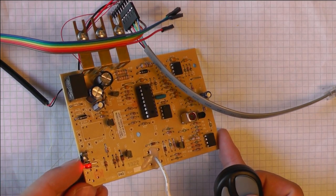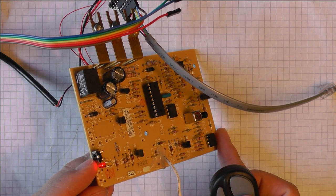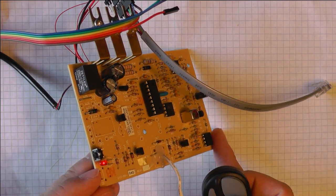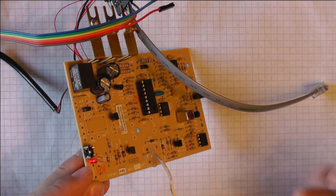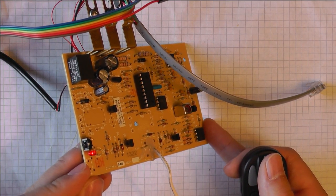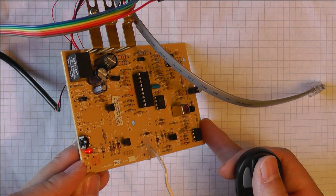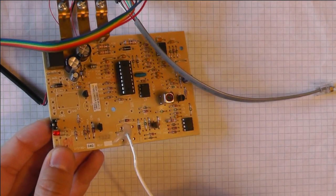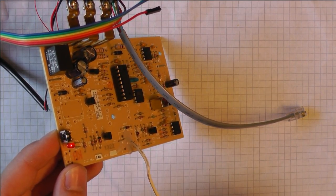If I want to reset the device, I just hold the button for 5 seconds. It blinks 10 times and then stays on. This goes through the whole I2C memory and erases everything, setting it to zero. We have to wait since it's a bit slow. Now it's finished — cleared. If I press again on the remote, the LED is on again, confirming we've just cleared the memory.